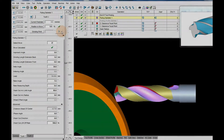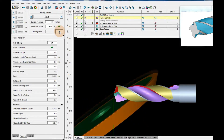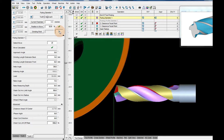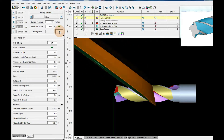Settings for making drill bit. Rollomatic mini power machine, Operation 1. Grinding wheel 1V1. Fluting. Wheel speed 16 or 19 m per second. Feed rate 16 mm per minute.